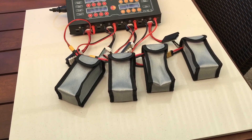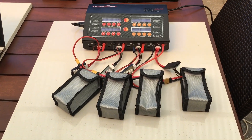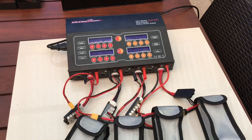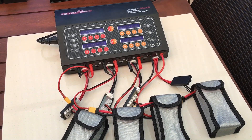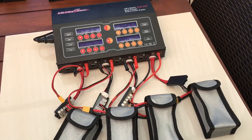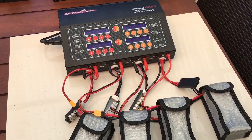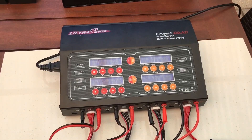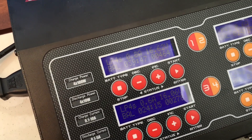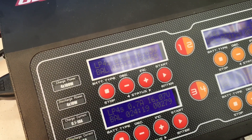There's an extra insurance policy: each battery gets its own little lipo sleeping bag. I put them in individual bags because if one catches on fire, the last thing I want is to lose four of my batteries. On my charger here — it's a four-port charger — each battery hooked up is receiving a balanced charge. It's not parallel charging; it's a single battery to each port.